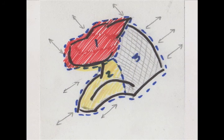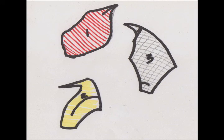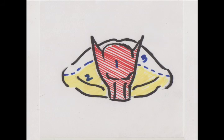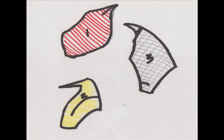As you can see in this particular drawing, we have arrows indicating how that mold is going to pull apart and in what sequence. A lot of that has to do with the number sequence that we use, the 1, 2, and 3. The first part of the mold that would come off would be the head casing. There are pry marks indicated; it's going to come off the main portion from the other two plates. But once that portion is removed, the other two parts of the mold are just a two-part mold that pops apart easily. They go out 180 degrees from each other.